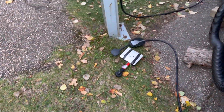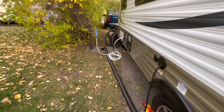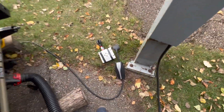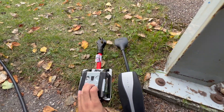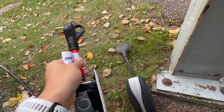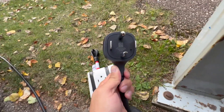We're in a campground right now and I have the mobile connector here. Follow me to the outlet so you guys can see. The trailer is hooked up to it. This site is fully serviced. I actually built this with my dad — it used to be a dog bone TT30 to 5-15, and we made it into this NEMA 14-30 connector.